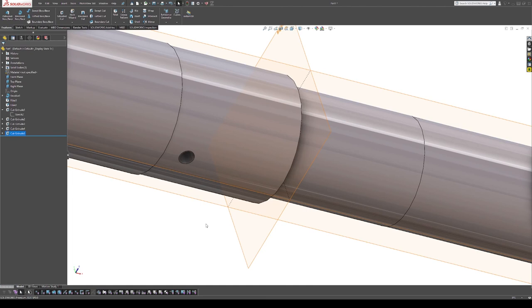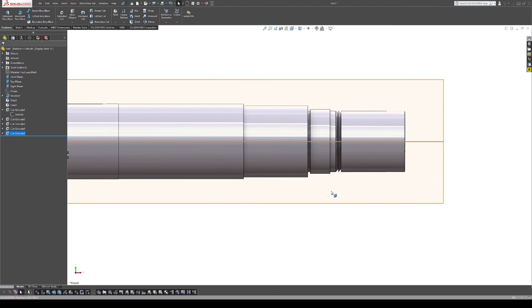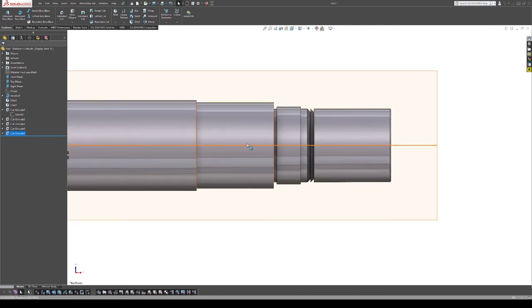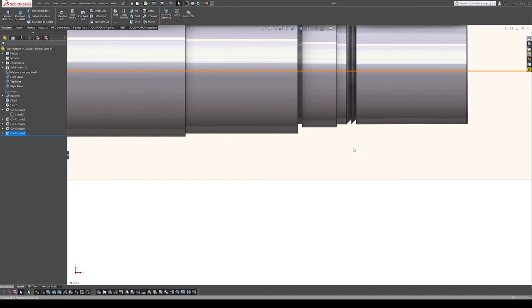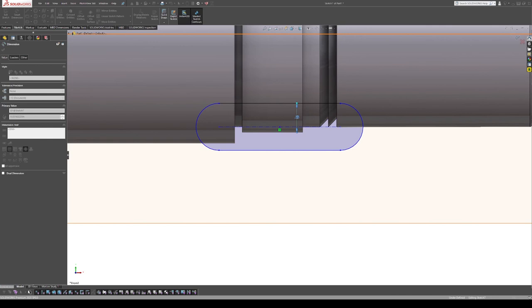This last one is a bit unusual — the key is cut from the bottom but it isn't a straight cut because it's cut with a rounded keyway cutter in a mill, so it has rounded edges. We're going to sketch this from the side as a slot. The deepest point of the key comes down to 0.0875 inches.